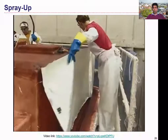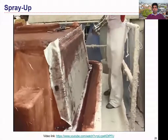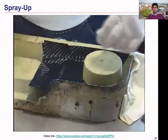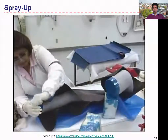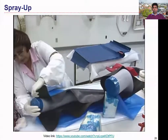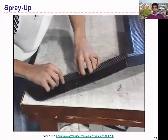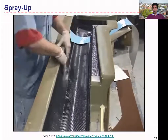Because of the difficulty of handling wet reinforcement materials, the technique of placing dry reinforcement in the mold and then subsequently saturating it with liquid resin is also commonly used for layup. Additionally, manual layup can also be performed using pre-preg or pre-impregnated material. Pre-preg combines partially cured resin with typically continuous or short unidirectional fibers in thin sheet or tape form. Pre-preg is tacky and will maintain its position during layup. In fabric form, it has sufficient flexibility or drape to conform to fairly complex shapes. Pre-preg reduces resin consumption and can improve part quality by providing more consistent control of reinforcement and resin contents.